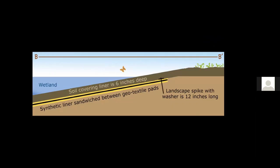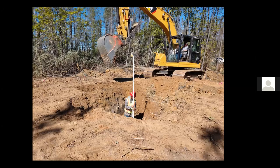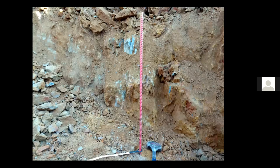Here's a profile view of using a synthetic liner. We protect the liner on both sides with a thick layer of geotextile, anchor the top edge with 12-inch spikes, and cover the liner with at least six inches of soil. We dig a deep hole in the center of the wetland, and the elevation at the bottom equals the final depth of the planned wetland plus the thickness of soil placed over the liner and layers of geotextile. We use a stake made of rebar driven into the center bottom of the hole — the bottom of the stake marks the target elevation — and attach a tape measure to this rebar.